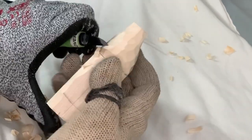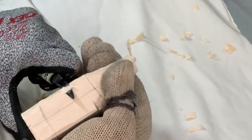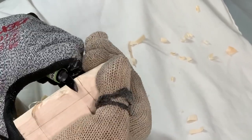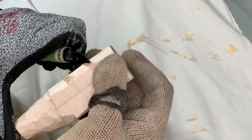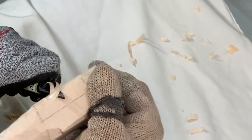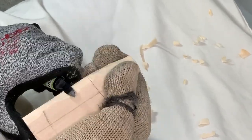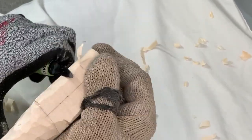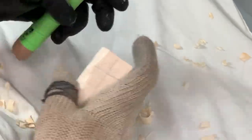On every piece of wood you carve, there's going to be some directional grain that can give you a problem. Sometimes you'll find a spot on every single piece where the grain kind of traverses across — and that can be a real challenge. Very often when you hit that spot, grab a gouge and cut across the grain. Let's keep shaping and rounding.